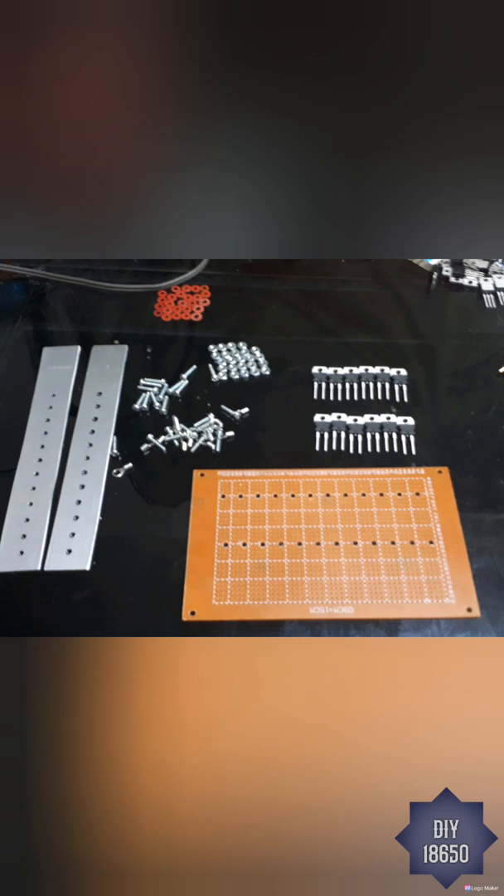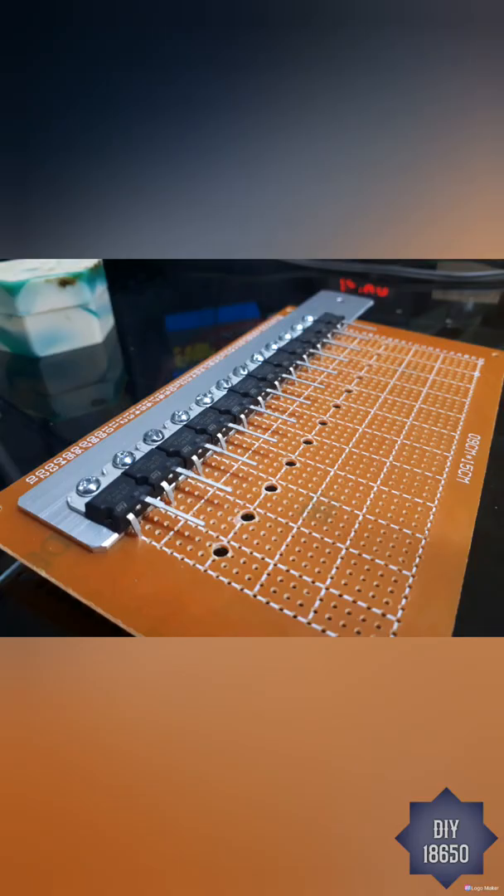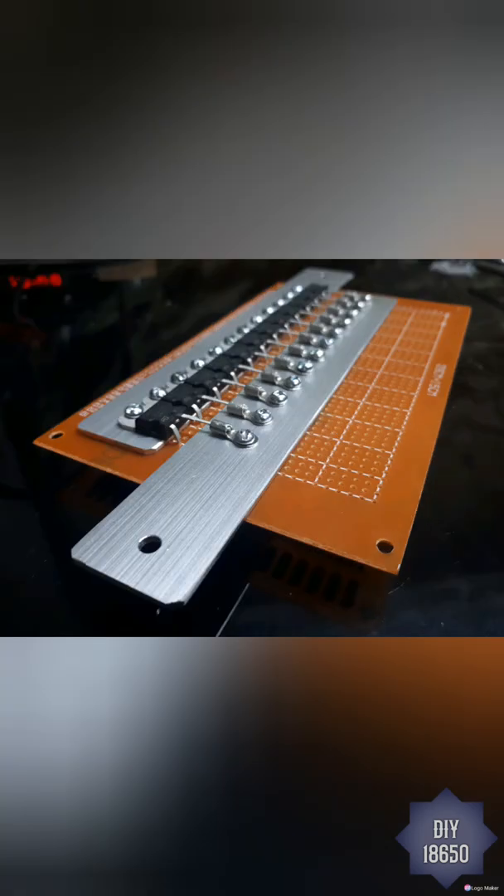Lay out all your material. Right now is when I would sand with emery cloth the back of the MOSFETs and the aluminum bars to make them conductive. Just for the build video I threw them together without sanding first just to get visuals. You'll see here the first legs, which are the gates of all the MOSFETs, are pushed through the first hole on line K and every fourth hole after that. The sources are just pinned up with the eyelets — everything mocked up. When I actually put it together I used a dremel to scrape away all the aluminum oxide from underneath the eyelets.